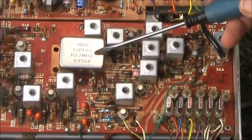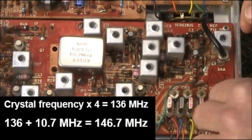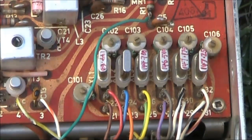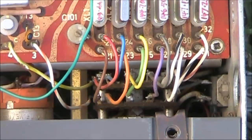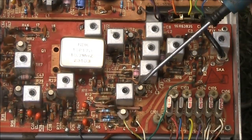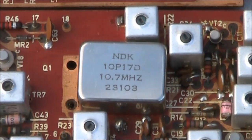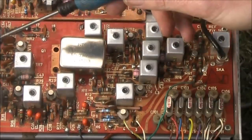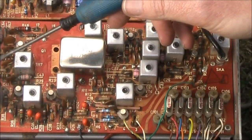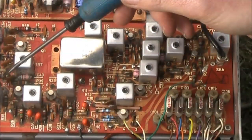That will be 10.7 megahertz away from the desired frequency. There are six crystal-controlled channels on receive. Each crystal has a trimmer capacitor so you can tune it in properly, and the coloured wires go to one section of the channel change switch. There's lots of cans in here, so it's very likely that some of these will be for the frequency multiplier for the local oscillator. Then an IF amplifier stage, and then the crystal filter. These look like more IF amplifiers — it's an FM receiver, and most of the gain will be in this part of the circuit, so these will all be resonant at around 10.7 megahertz.